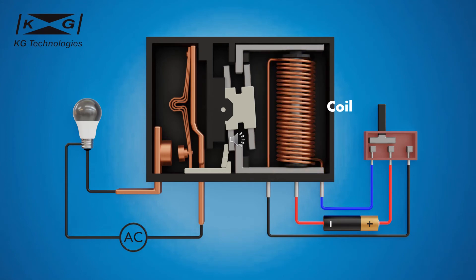The coil is made by winding enameled copper wire around a plastic bobbin. There are two types of coils: single coils and dual coils. For the single coil, there's only one coil with two coil pins. For the dual coil, there are two coils with three coil pins. To generate magnetic fields with opposite polarities, we change the direction of the current flow through the coil.